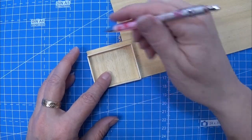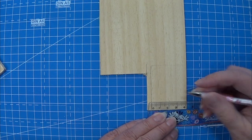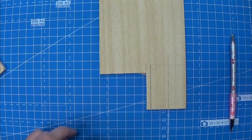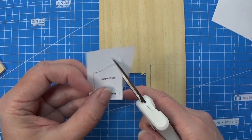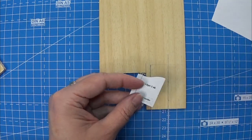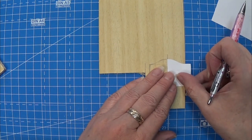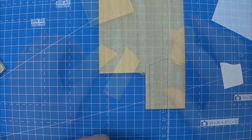Now for the doors. I am first drawing up the bottom part onto my piece of wood. I am measuring out the halfway mark on these cabinet doors so I can mark the line where I have to cut. I made it a bit longer because I want the bowed shape on top that we have on the piece of paper, so I am cutting that top part out. I line it up so the top part is on the middle line and the low point of the bow is touching the side walls. Then I flip it over and do the exact same on the other side, then carefully cut all of this out and sand all the pieces.